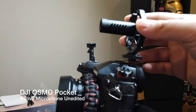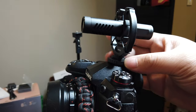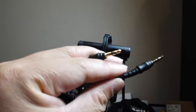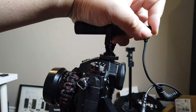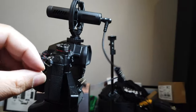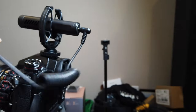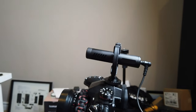To install this, all you need to do is mount it up here like so, tighten it up, and then grab the cable provided in the box and connect it in the back. It doesn't matter which end you use on the N2 — it's the same end, it's a TRRS connector, so you don't have to worry about that. There you go, all good.